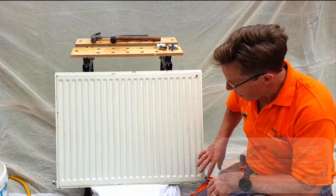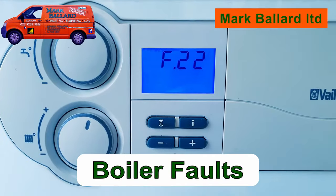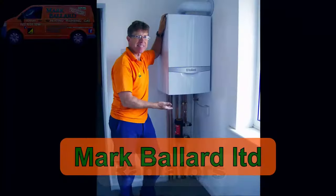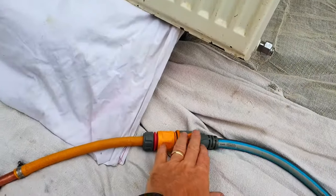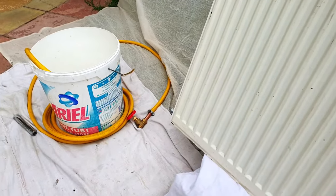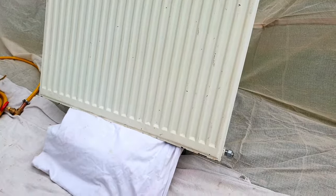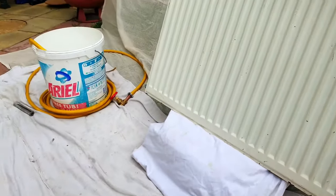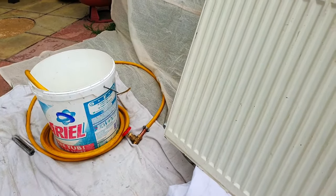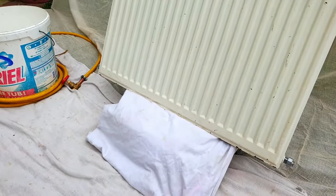Right, now let's get cracking. I'm going to show you how you can flush out this radiator and get rid of all that dirty black sludge. So we could just get our hose pipe and attach it onto one end and just let the water flow through and dispose of the water into a bucket or into a drain, but that's not the way I'm going to do it. Before that, just make sure that when you are flushing this out, you flush the water into a bucket or straight down a drain or into a part of the garden you're not going to be walking on. Don't flush onto your patio or onto your lawn because this black magnetite is terrible to get out.